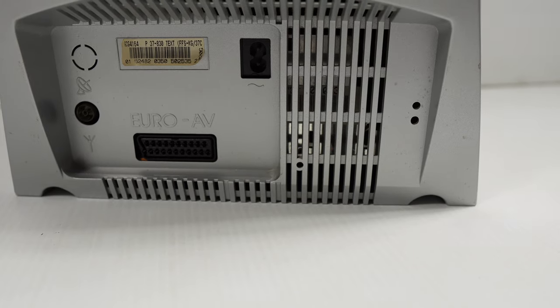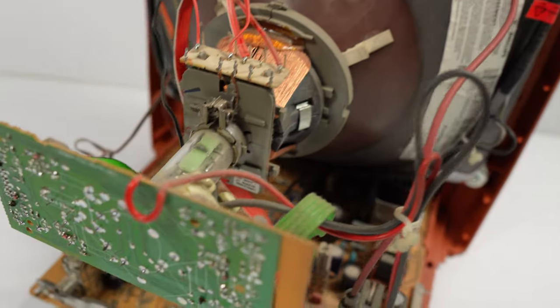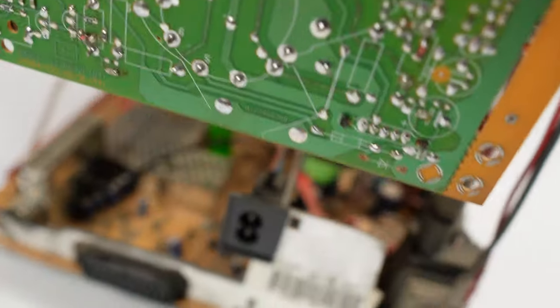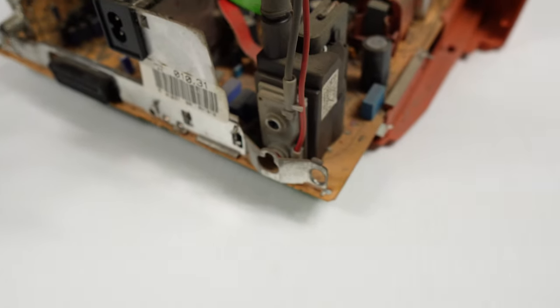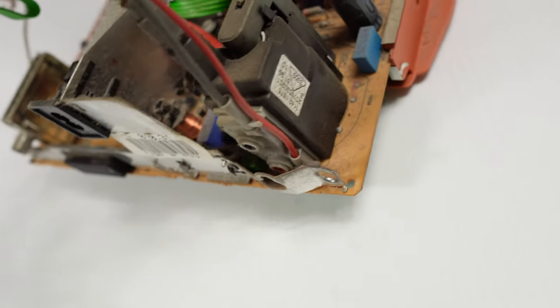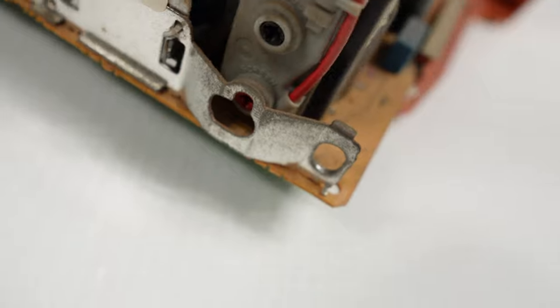Grundig's designs never include a hard-wired cable, not around this era anyway. Pretty basic inside. Look at the notch on the neckboard to fit that lead in — a little tricky. Down here there's a trimmer accessible through one of those holes. In the service manual, there are a couple of trimmers on the chassis used to adjust white balance, and it says just to adjust them by eye — you don't need a specific electronic tool to measure the values. There's also the flyback with screen and focus adjustments on the side.